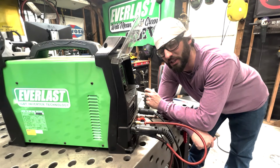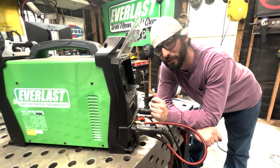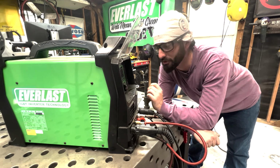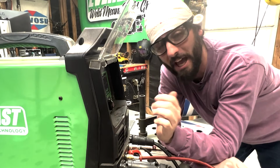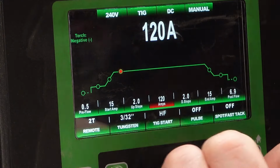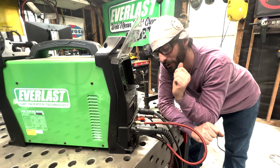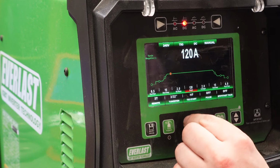Now, I was a little nosy, Max, and I hopped in your comment section to see if I could help and see what your situation was. You're running on a machine that just has scratch start features and none of these fancy bells and whistles that this Typhoon 230 has. And if I had it my way, Max, I'd want a machine that has high frequency start, some sort of remote, and capabilities of adjusting our waveform so that we don't have to give her the punch right off the jump. We're going to try to replicate all of those things today.